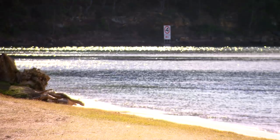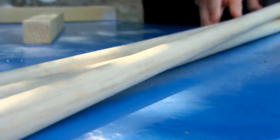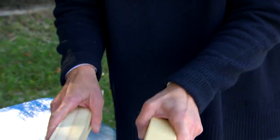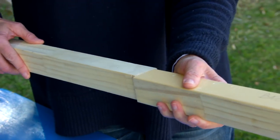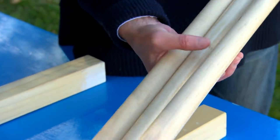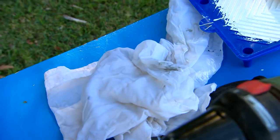Our cabin, like many holiday houses, is a little on the small side so we need to make the most of every available square inch of space. I've got a couple of great space-saving ideas, starting with a luggage rack. I've got some timber — this is 42mm square, docked down to two equal lengths — and some long lengths of dowel. I'm choosing a lime wash finish: just get some plain white paint, pop it on, and before it has time to dry wipe it back very gently with a damp cloth.